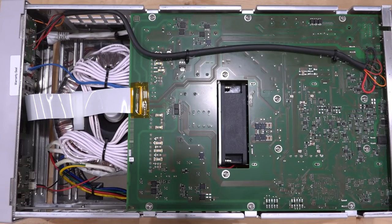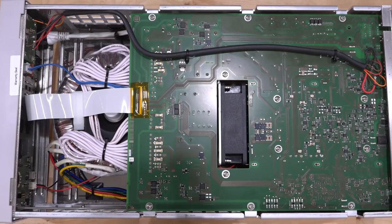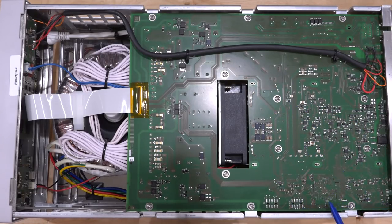There are a couple of MOSFET switches — high-performance, low-resistance — across or in series with the very large capacitors. I think these may relate to the voltage or current priority setting, potentially used to dump charge from the capacitors onto the load in a current priority mode — that's my guess from the wiring. The back of the FPGA and microprocessor are visible with the BGA footprints clearly visible. One minor criticism: I'm not a big fan of routing the main output to the front panel using soldered connections — I prefer connectorized, gold-plated connections like Keithley uses, for better serviceability.